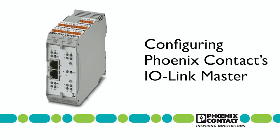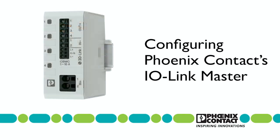In this video, we're going to walk through the minimum requirements necessary to set up Phoenix Contact's new IP20 IO-Link Master and load it into RSLogix software environment. The first step is to configure the master and any connected IO-Link slave devices. For this example, we've connected an IO-Link enabled CBMC breaker.